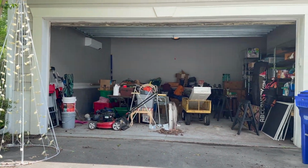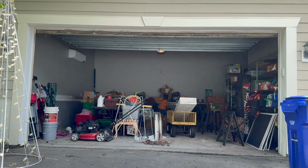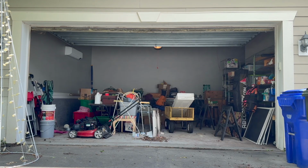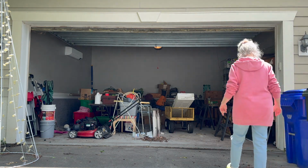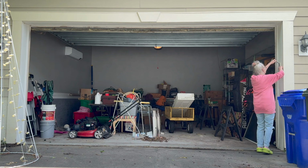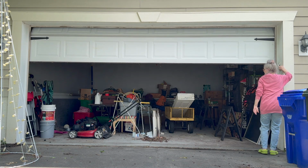Our next project is we'll have the garage door insulated. We have a 16-foot garage door, and it's just regular panels, but they make panels that we just cut to size. It's just a 1-inch foam that goes in the openings in the door and the panels. And because where we are in South Carolina, we have steel reinforcing across our garage door. We have 8 of these bars, so our door is rated for 150 miles an hour. I hope we don't ever have to use that.